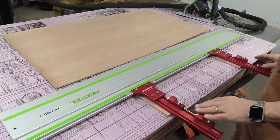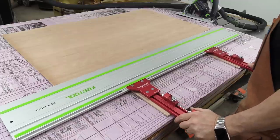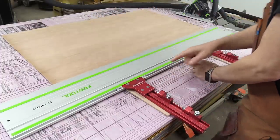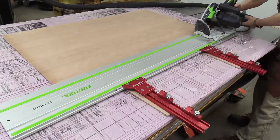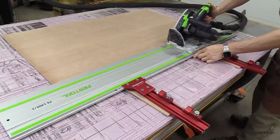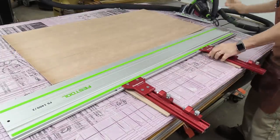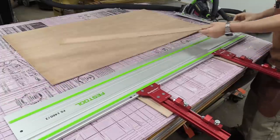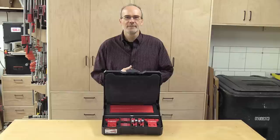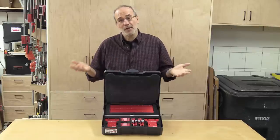Now that I have the narrow stock guide set to the right depth of cut, I've put a couple pieces of scrap underneath here just to raise these back pieces up a little bit. I'm just going to put it right on the plywood, butt it up to those two posts, and go ahead and make the cut. Just to check the accuracy — I'm at an inch and a half. As you can see, Woodpecker's Parallel Guide System gives you table-saw-like accuracy and repeatability, without using a table saw.